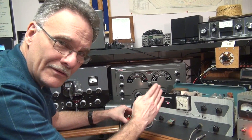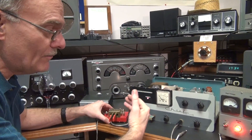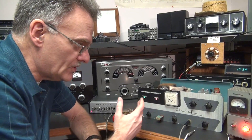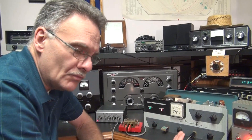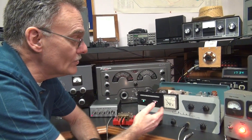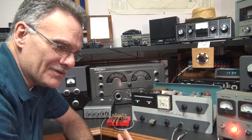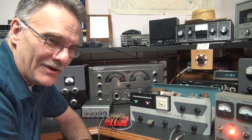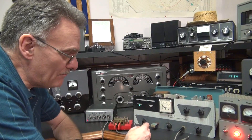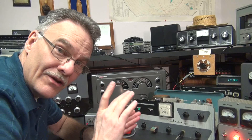The only issue is the old floppy meter — that's really got to go. On some of these conversions I have actually changed it out with a standard meter, which gives you a nice smooth response like you'd see on any transmitter. Unfortunately this old style would boing-boing around. This is the same kind of meter they used on old vintage battery chargers. They probably should have upgraded that meter, but it's still a very cool transmitter.